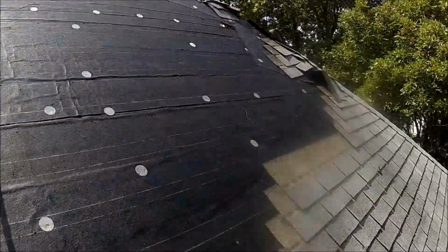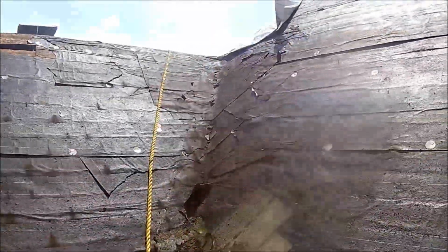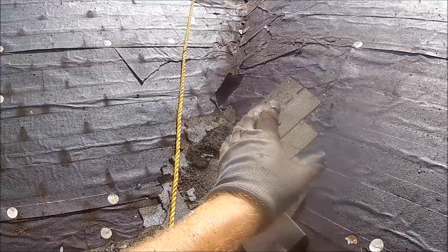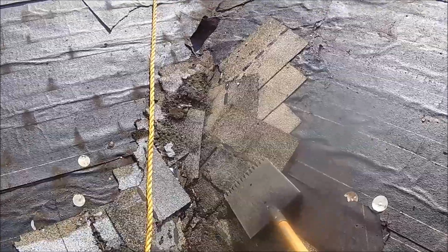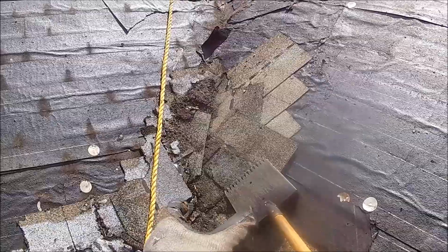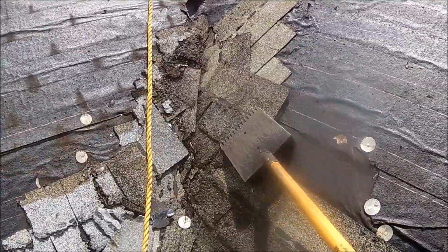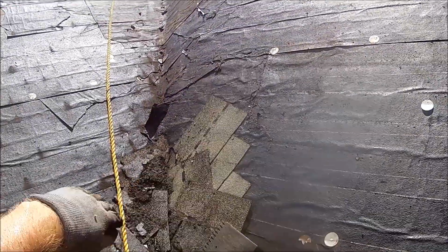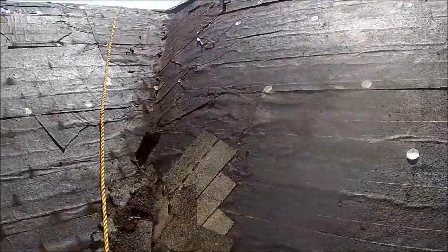Alright, almost done here. The very bottom. Quick note on this particular side, I want to start my shingles up the valley here first. This is going to be overlapped up here, just like you see, and then I'll put my extra shingle going up for the valley, and I'll stop the shingles going this way on that shingle. Just keep in mind that I want to go up this way because this is the shorter side, so we're going to go up and then go the other way.